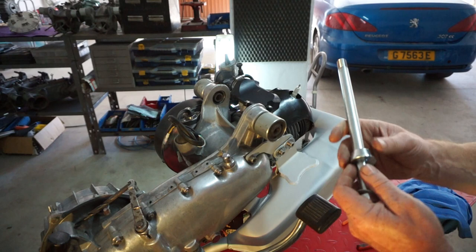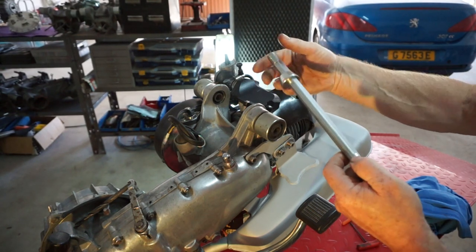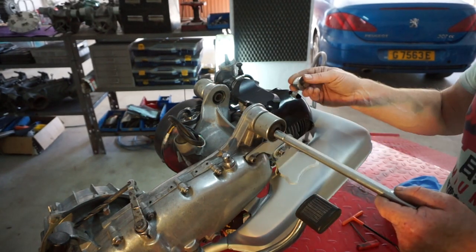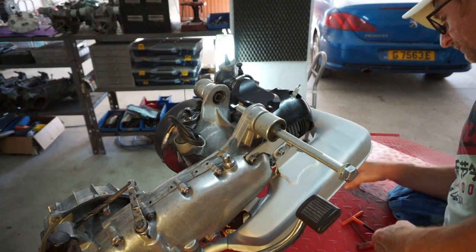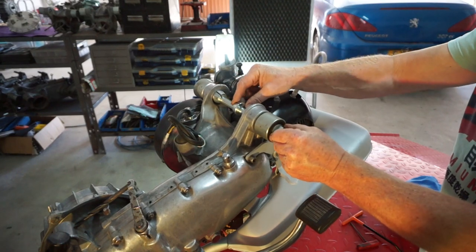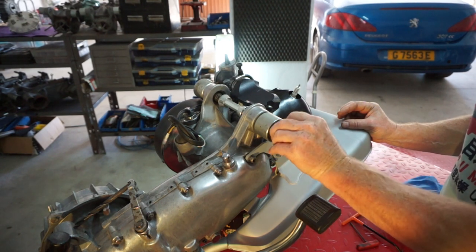This is our offset bar - it's got a flat on here on this part, and a flat inside these offset cones, so they're D-shaped on the inside. They slide on, but when you rotate they have to follow the shaft, so they can't get twisted in the chassis, which is always a problem. So when they go in, one will be like that and the other one will be like this. When your cones are inside, you can rotate and position your engine relative to the chassis more or less where you want it.